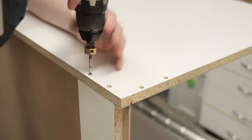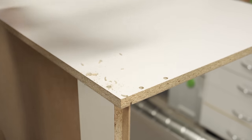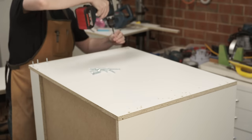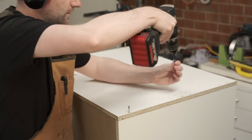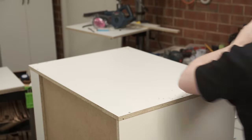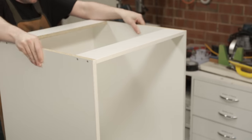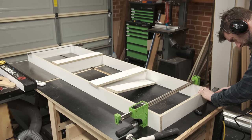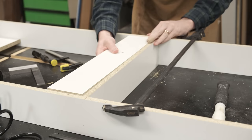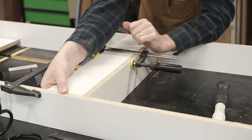The top that sits on top of everything hides everything visually and provides enough rigidity. The base cabinets are just boxes - they'll sit on top of a plinth, which provides somewhere to attach feet, somewhere to level, and provides the inset for the toe kick. I'll be making two plinths: one for two cabinets and one for three cabinets.